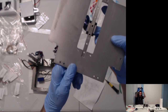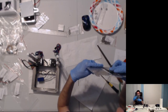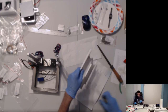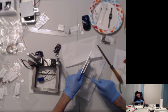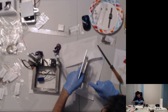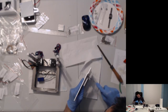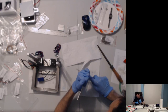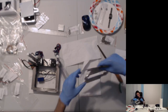We're definitely long enough. There's about a 1 millimeter gap. If you angle it just so, you can see the gap of light right here. So we're long enough, we're not wide enough. Got it, I think. I'm gonna try to do a uniform number of passes on each side. And that would involve counting how many passes on each side I'm doing, which I've already not done. That's roughly 10. I'll take 10 off of here, and we'll take 10 off of here. Take 10 over here.